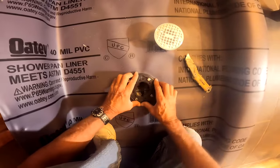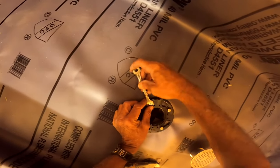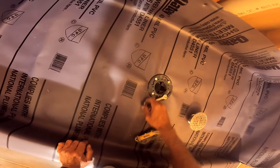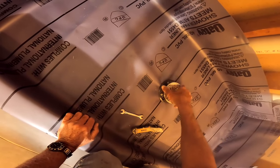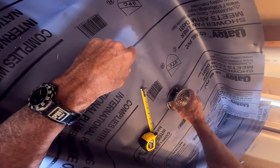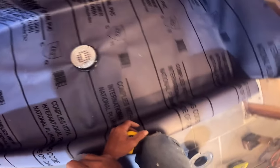You want a nice tight fit pushing the locking flange down and turning it into the bolt recesses. Get those bolts really tight. The four flaps of the pan liner go inside the drain — that locking flange has about two inches of girth going down into the drain. I back off the drain in a counter-clockwise fashion to hear a click, confirming the threads are seated correctly. My screws end up lined up front to back or left to right — it's an OCD thing, but about an inch and a quarter to an inch and a half on the mortar thickness around the barrel of the drain.